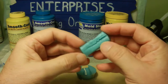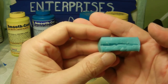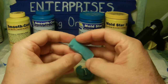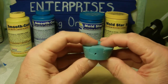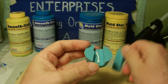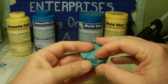Once that was cured, this is what I came up with — the second half of the two-part mold. You can see a nice impression of the shotgun and some of the little registration key points. I pried off the plastic, and we ended up with a nice perfect fit. I carefully peeled back this part of it, took out the shotgun, and then put it back in place.